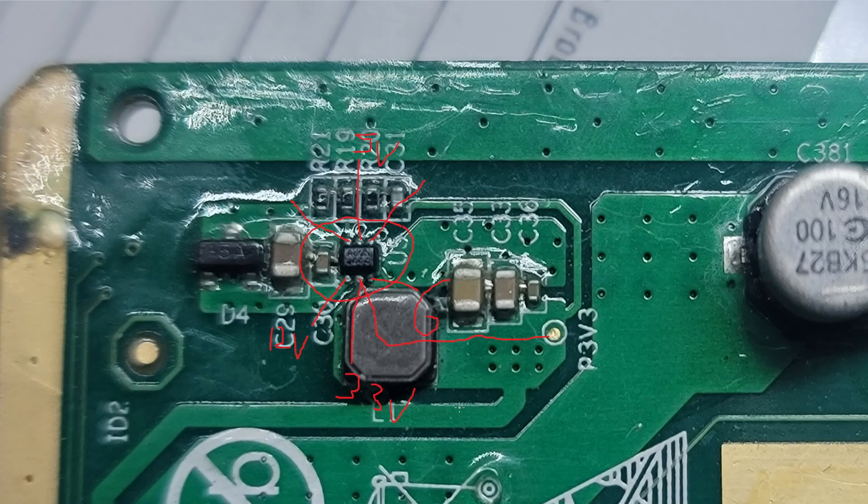So if you are missing the 3.3 but you have both 5 volt on the enable and 12 volt on the input, then the chip is most likely bad and that's when you go ahead and change it out. I'm going to show you changing one out — it's teeny tiny, it looks big in this picture but it is teeny tiny and can be a pain to change. These chips are readily available pretty much anywhere, and I'll leave the part number down in the description if you need it.